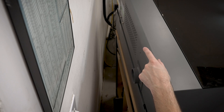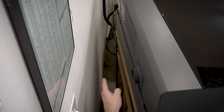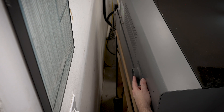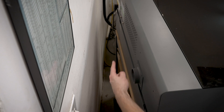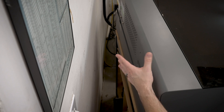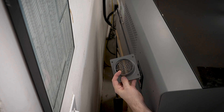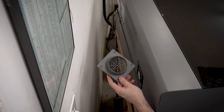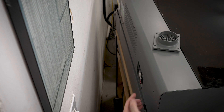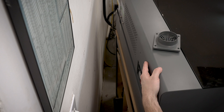So we're looking at the top back of the CO2 laser. We've got the exhaust right there and the wall is right here — this is actually pulled out quite a bit. Normally it'd be sitting about here, so there's just a few inches between the wall and the back of the laser. For this exhaust port I want it to come out and move at a right angle, kind of elbow out that way, because the air filter is several feet over and the hose really isn't that long. The other issue is there's a bunch of obstruction here — probably to prevent debris from going in — but the air filter already handles that, so we're just going to redesign that whole part from scratch. And since it's all the way on this side of the machine, it would be nice if the elbow went a little further so I don't have to stretch the hose quite as far.